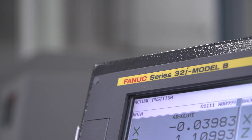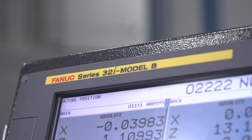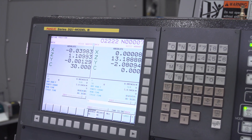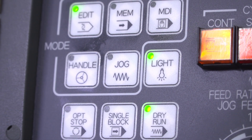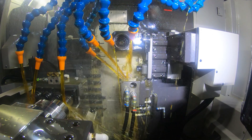The Sagami S206 Mark II is controlled by a FANUC series 32i Model B dual path that comes standard with a 10.4-inch colored LCD loaded with options. From 512 kilobytes of memory, all the canned cycles, custom macro B, cylindrical, helical, and polar interpolation, 0.1 micron specifications with 10 millionths minimum increment capability, plus cutoff breakage detection — just to name a few of the key options out of over 40 that are standard with the Sagami S206 Mark II.